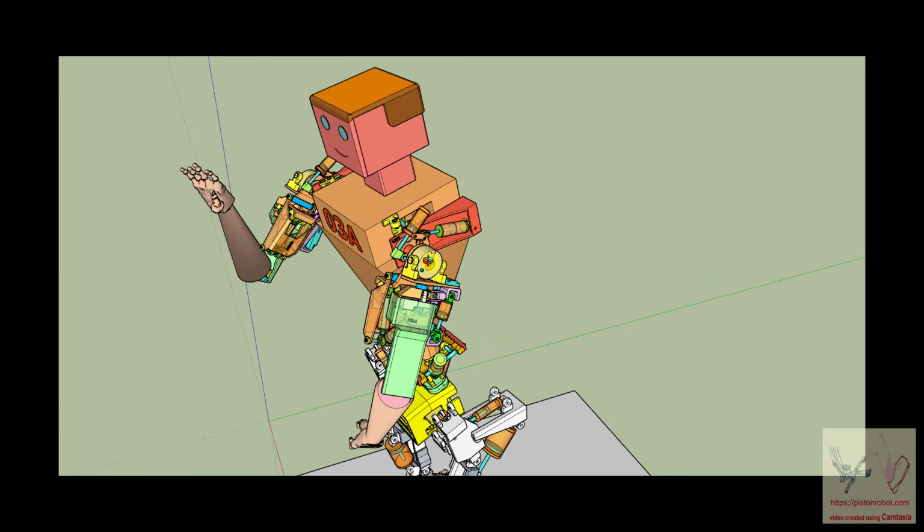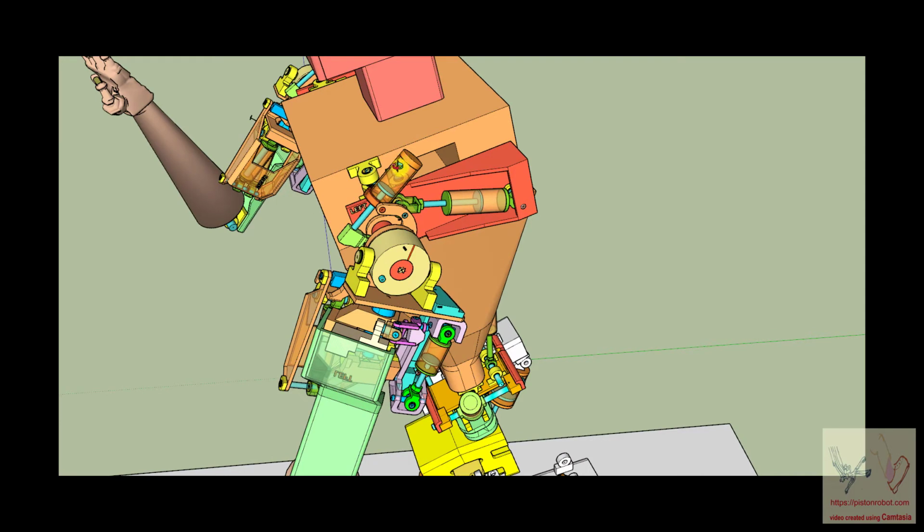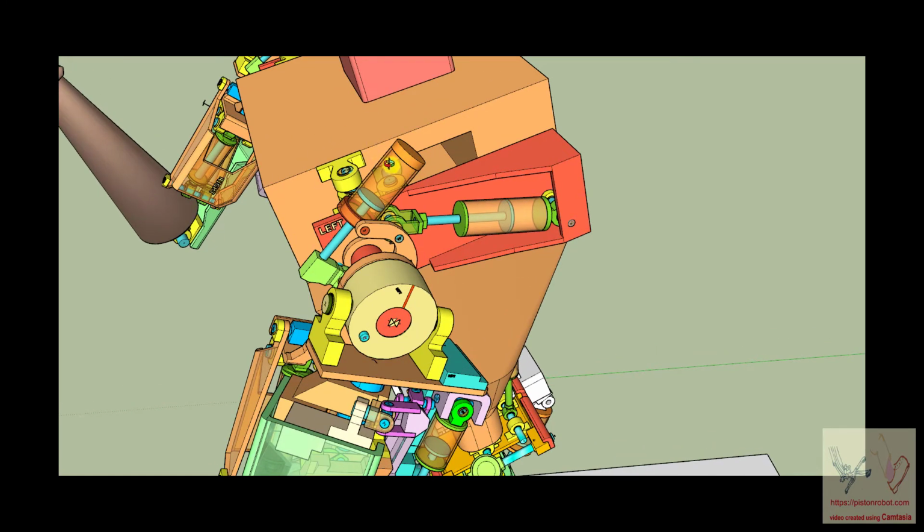But what I wanted to discuss is, I thought it would be fun to try to get this to be a robot that was a toy that people could assemble and have some fun with it. But controlling a piston is tough, because you have to have fluid under pressure, have to have valves. If you want this to go that way, you have to take fluid out of this side and you have to put fluid into this side, and the fluid coming into this side has to be pressurized, and the fluid coming from that side has to go back to the pump.